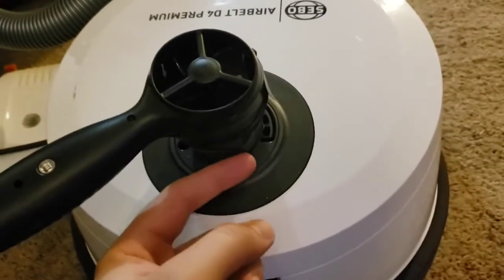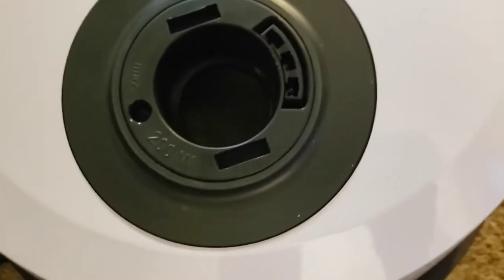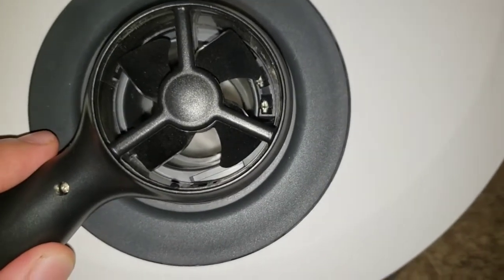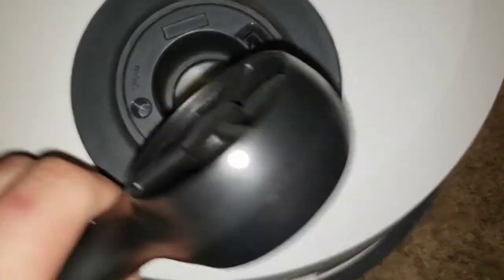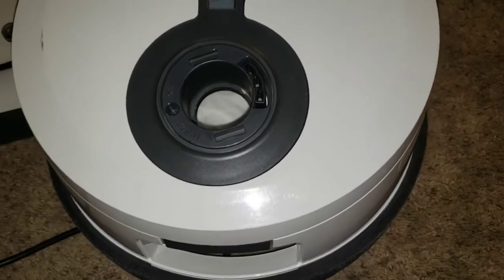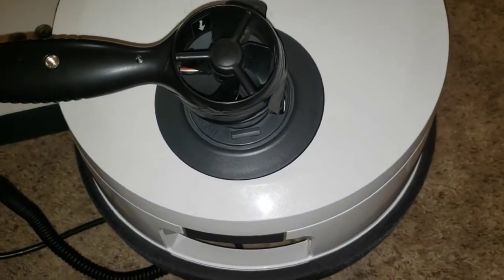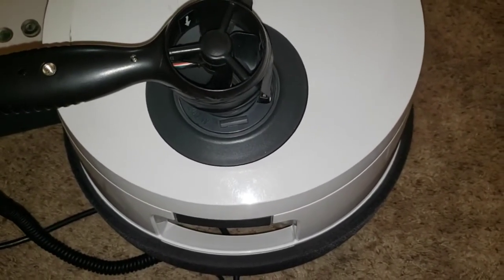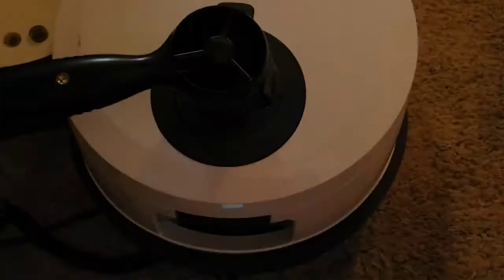Using the cone in here is going to be a little restrictive, but the inlet is a little bit smaller than the vane area. If the area we're measuring is smaller than the vane, it's going to concentrate the airflow into a smaller point and give us readings that are higher than they should be. So I'm going to go ahead and use the cone, although I know that's going to result in a little bit of a reduction. Power here doesn't really matter too much — it's more what we're going to see at the end of the hose and at the nozzle that's most important.